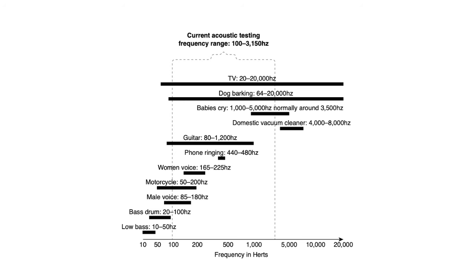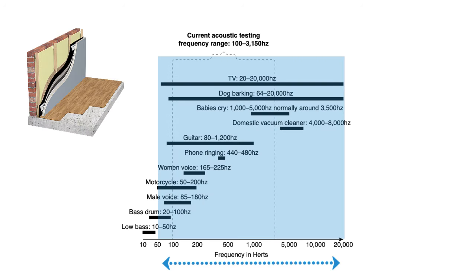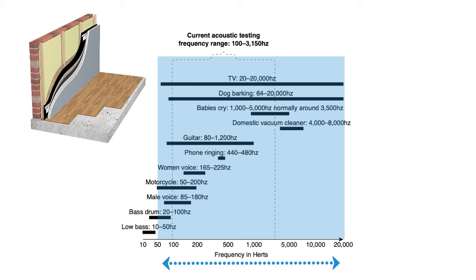We're talking about impact noise and structural-borne noises because we've used a resilient bar, and that's what resilient bars and resilient channels do — they deal with lower frequencies of noise: those clunks, clangs, and bass noise coming through. If you want to reduce that type of noise, you really need to consider using resilient bars or a resilient channel system.